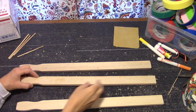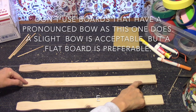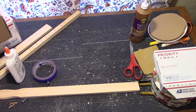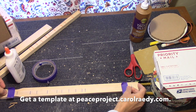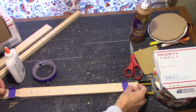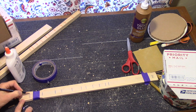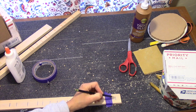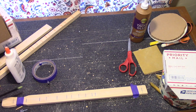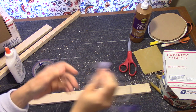This board has a curve in it — I can tell because when I lay it down and push on one end, you can see it's like a little seesaw. Then I'm going to tape on the template. The little curved-out end here will be where you have the frets. We'll put this on and mark on each side of the mark with your pencil. Don't forget the one down at the end — that's for the bridge. Now remove the template and save it to make another one.